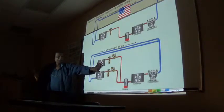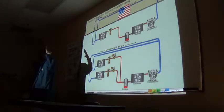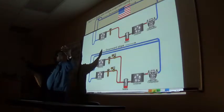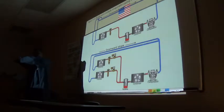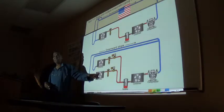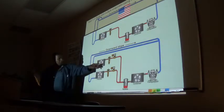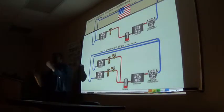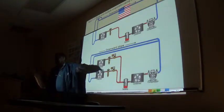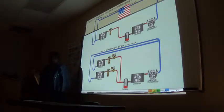One of the reasons they have this set up here: imagine this is in this room, both of them. Essentially one unit will not cool this room because you're not going to get airflow covering the whole 360. And once we use two of these, you're practically creating two temperature zones. So we're going to have two separate thermostats, one on this, one there. When this section is cooled down enough, it cycles off this one and allows that to run. Hence, the need for two separate lines.